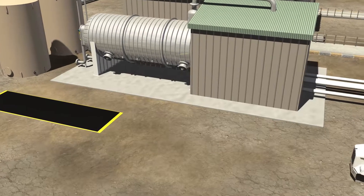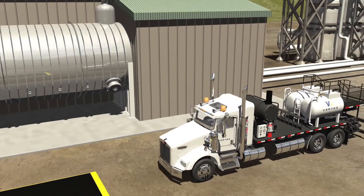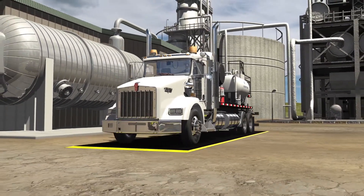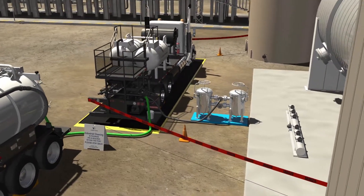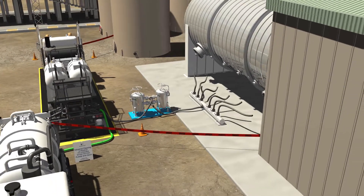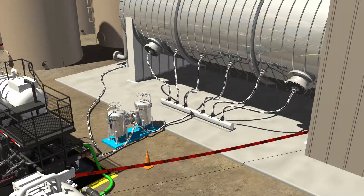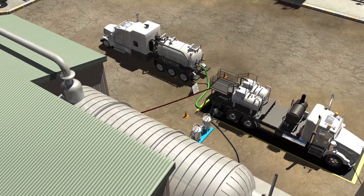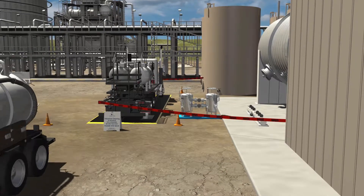To prevent the frequency of large-scale and heavily labor-intensive industrial cleaning, Vertex also provides clients with routine maintenance chemical cleaning services. Chemical cleaning serves as a preventative maintenance option for exchangers, dehydrators, or towers. The proper chemical solutions are mixed in the chemical unit tank, and hoses are connected to the inlet and outlet of the item that requires cleaning. The chemical unit is turned on to allow the chemicals to circulate throughout the lines of each asset. When cleaning is completed, the used chemical and debris is captured in the holding tank of the vacuum truck for disposal, and the vacuum truck is then driven to an approved disposal facility.